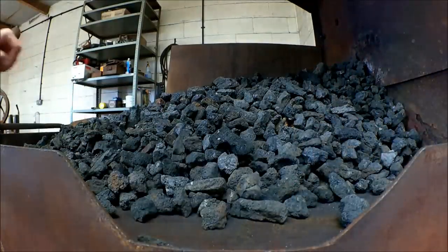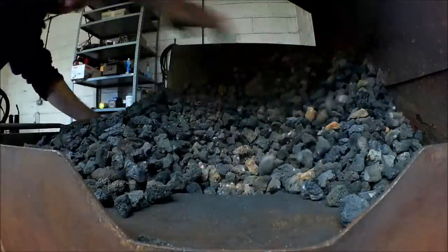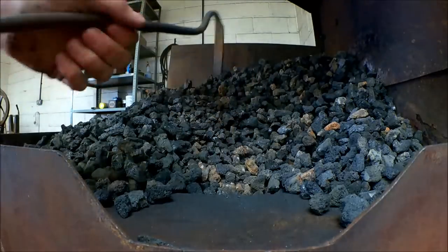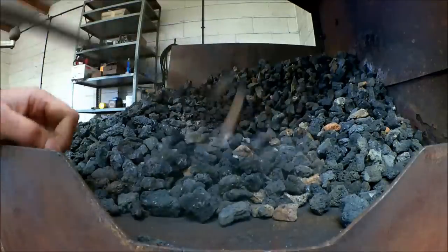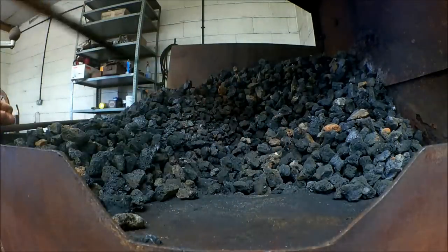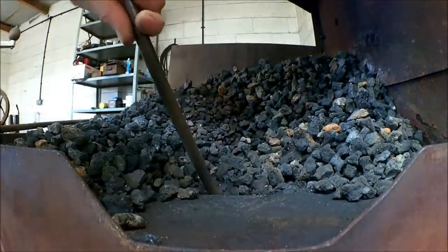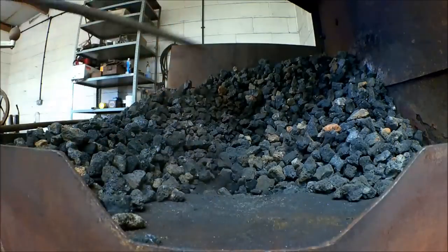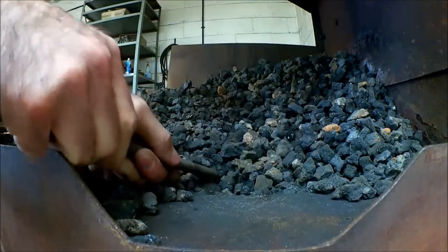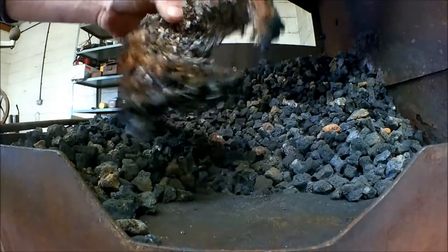Now I'm going to demonstrate how I clean my fire. I turn it back like this, and I use a tool — a rake, a scraper — and I start digging out a little bit. Since the last time I forged it hasn't been cleaned out because it's been too hot. So every morning I have to remove what's called the clinker. You just stick your poker in the fire and start pulling it out. This is the size of the clinker I had last time.